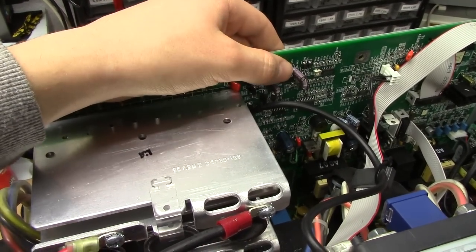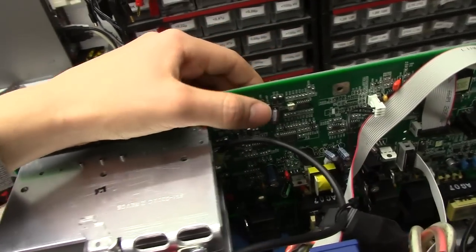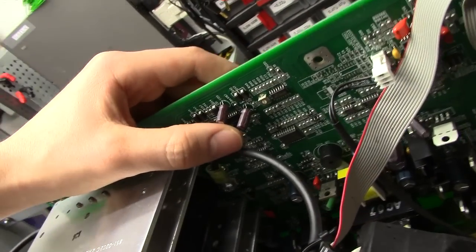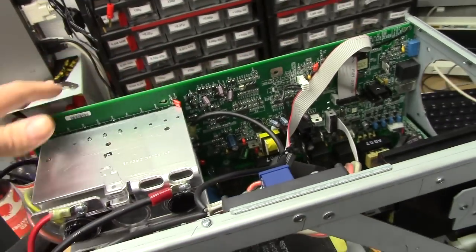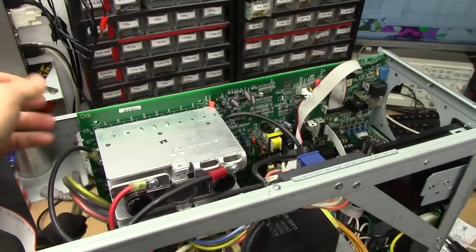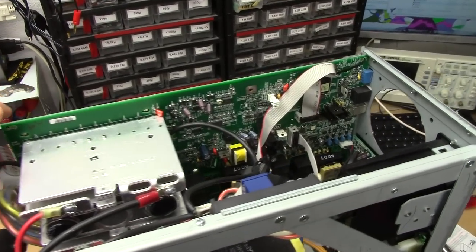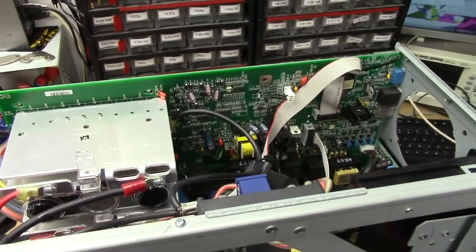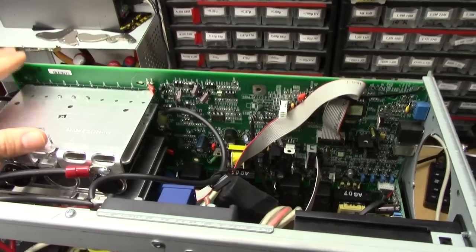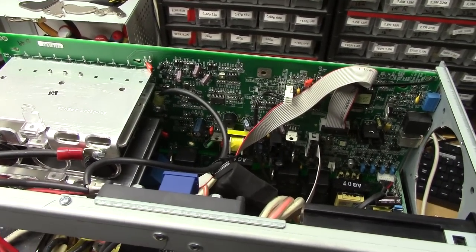And this one, they are 22 microfarad, 25 volt Jamicons. I haven't checked the series, might be TL series, it seems. And they measure just fine, they measure pretty much like my new replacement caps. So that's all fine and dandy. Same goes for pretty much all the other caps inside. I'm quite surprised, actually. Never seen this in an APC that's this old before.